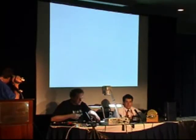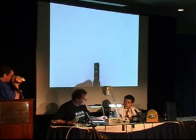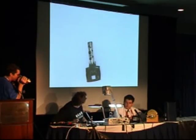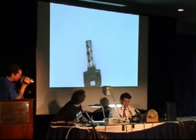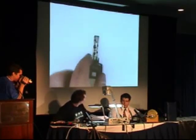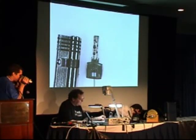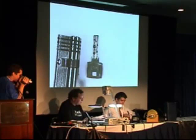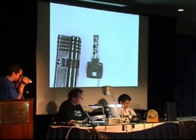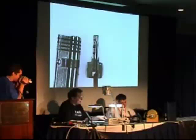There's also something else that I don't think has been demonstrated quite a lot. People ask me about dimple keys. That's this type. I have here a cutaway Dom lock, and it has five dimples, which means just holes. And here's a little ball, and the little ball is an extra protection. When you insert the key into the lock, the little ball will be pushed up, so it reaches a higher point than the blank normally can get. And that's also a copy protection, because in this way, nobody can make a blank for this key.